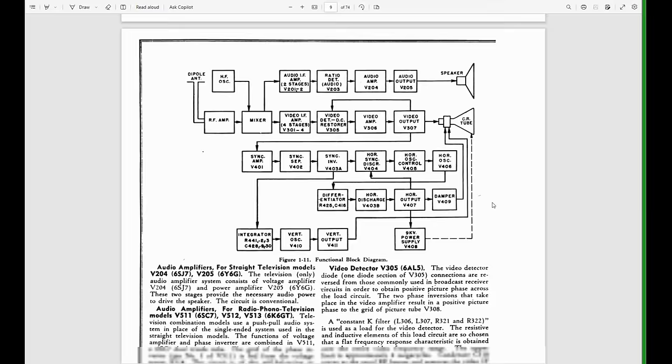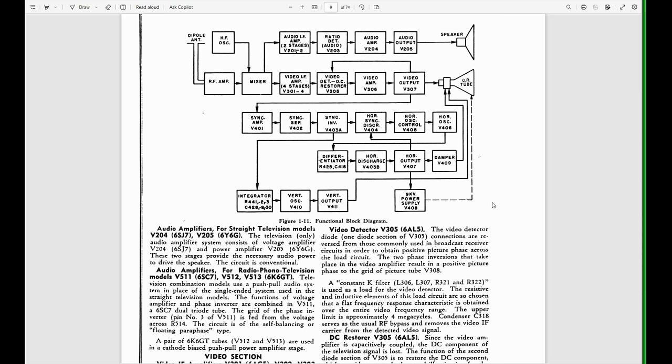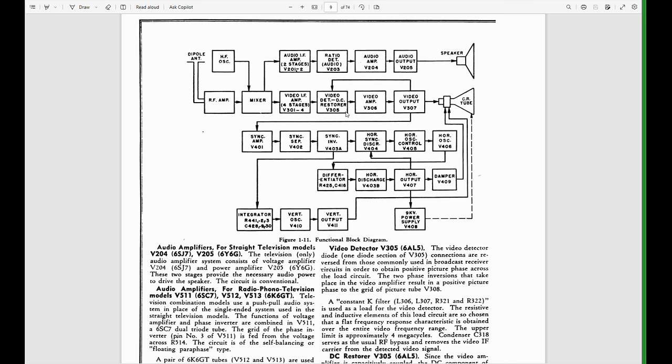We're going to have to very carefully compare the tube lineup to what we see here. And when we start looking at the schematic, look for any production changes, identify all the parts, make sure everything matches up. All that aside, it actually is pretty good service info once you decipher and find what is applicable to your exact model. I say that because we now get a nice block diagram where they break down what each tube is for.